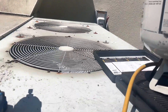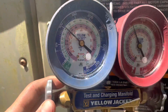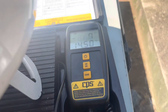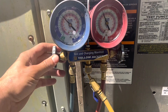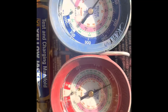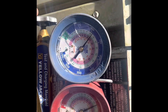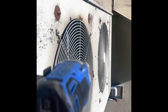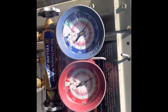All right guys, we're cycling it on — both circuits one and two are running. It is a little bit low, so we've got to get to 12 pounds. I'm just going to meter it in little by little through the vapor side. We added in the factory charge — it's actually 11 pounds, not 12, sorry about that. Circuit two is charged, both circuits are running. I'll let it run for a little bit — this is another successful job, thanks for watching, see you next week.